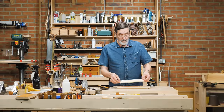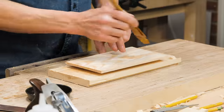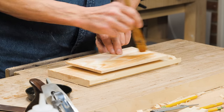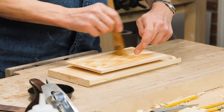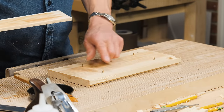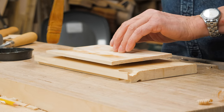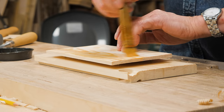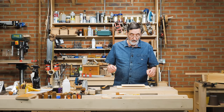Sometimes when you've got a piece of wood or a small project that you want to put some finish on, you put the shellac on it but then you don't know what to do about the other side. If you put four screws through a piece of wood like I've done here, flip that over, then you can apply the other side. All you've got is four very tiny dots in the surface that won't show when you've finished.